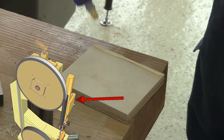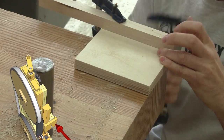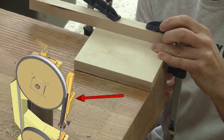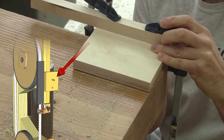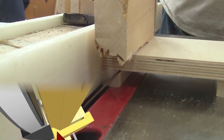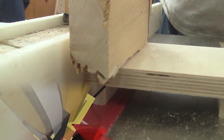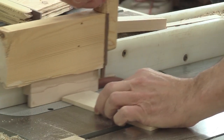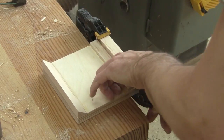I have a guide, but I can't put it in place without some kind of support to hold it. So the first thing I do for the clamp is glue a piece of maple on a piece of plywood. When the glue is dry, I cut the maple at forty-five degrees. I also cut an L-shaped piece of wood and glue it at the back of the clamp.